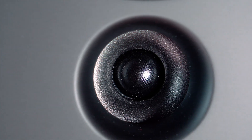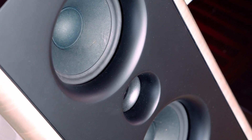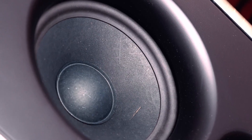The 25mm silk dome tweeter — or better to say super tweeter — because it's cut around 13–14 kHz, comes with only capacitors as crossover, and that's it. It's mounted inside a beautiful sort of horn waveguide to have less energy reflections in untreated rooms. Massimiliano told me he is not a crossover lover — his philosophy is that crossovers remove a sort of musicality from the speaker. For the woofer, same thing: no crossover, with a mechanical damping of the membrane as a treatment on the driver instead, for a natural controlled decrease in frequency response. No crossover at all — crazy.